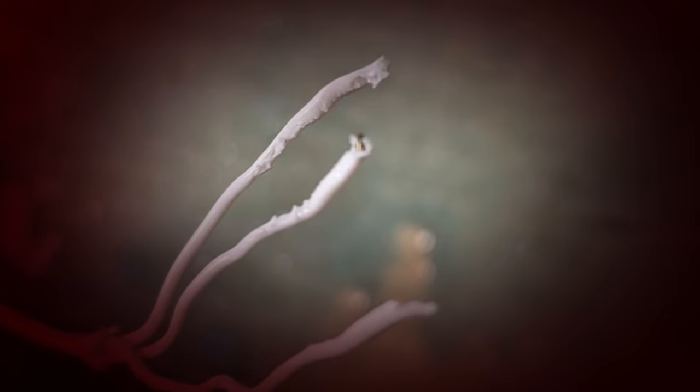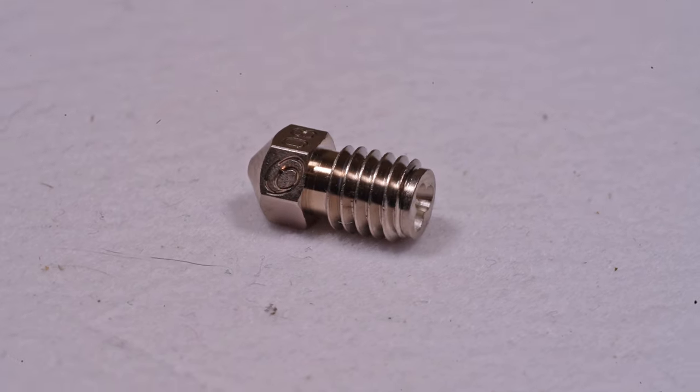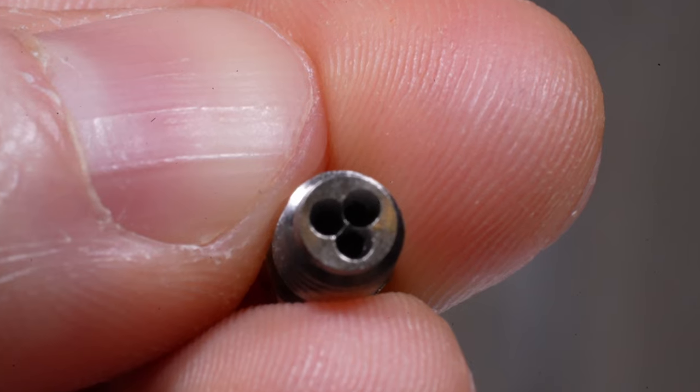And now the thing you've all been waiting for — the revelation of who's at fault for the nozzle clog I teased in the intro. Here comes the big surprise: I was using brand name material from the German manufacturer Das Filament when that happened. There certainly was no cheap material involved. But I can't even guarantee that the metal flake originated from the filament — it looked like brass, so it might as well have been a manufacturing residue from the nozzle. I was using a Bondtech CHT nozzle at that time; with its three separate holes it's certainly more complex to manufacture. Since I can't tell for sure, I won't blame anyone. Besides, this was nothing a quick cold pull couldn't fix — that's when you heat the nozzle from room temperature and pull the contained filament out as soon as it starts getting soft. It's an easy way to get most residue out of a clogged nozzle. With a regular nozzle you get one string of filament; with a CHT nozzle you get three strands. Looks pretty neat and works just as fine.